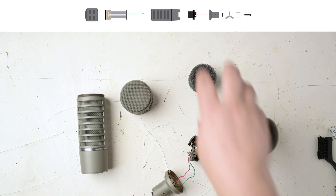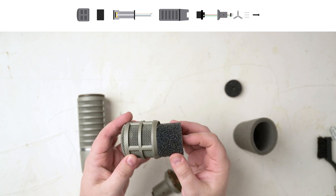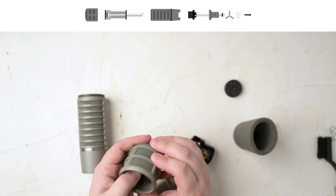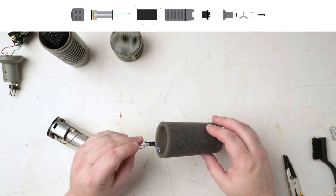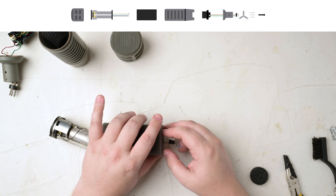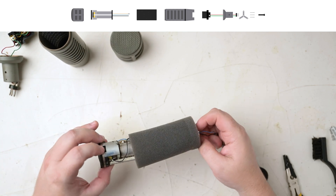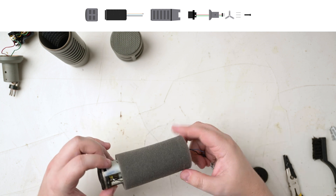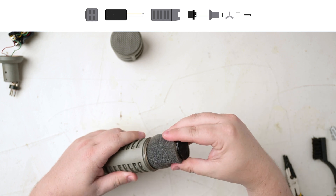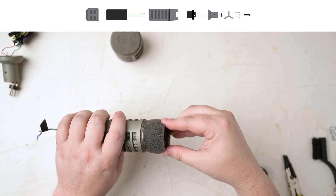Time for reassembly. This coarse piece goes in the head basket. The motor assembly goes into the kind of sleeve piece with the blue, black, and ground wires feeding through the hole in the bottom. It's tricky to get all three threaded through so I used a little tape to keep the ends together. Then the whole thing gets shoved into the body of the mic — it is a tight fit and takes some convincing, but I tried to keep from putting too much pressure near the mic capsule.